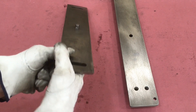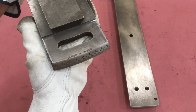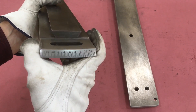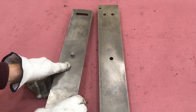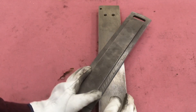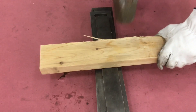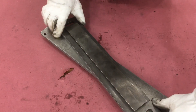These two pieces are the heart of the taper attachment. This is the swivel bar. It goes on top and one end is delineated in degrees taper and the other is inches per foot. They are tacked together and swivel with a half-inch pin. The base is stationary generally and the top portion swivels to create the appropriate taper. Both pieces are almost identical and each have a slide portion with 45 degrees on each side. Here you can see how the swivel works.